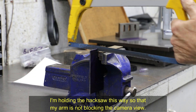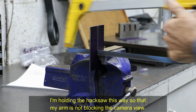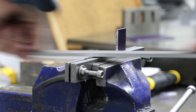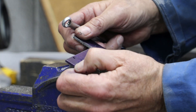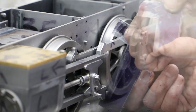After marking out the main section that needs to be cut away, I get busy with the hacksaw and some files. You may notice that I split the parts and I'm now only working on one of the pair. To help with the filing I've got the workpiece bolted between two bits of bar — they're not hardened but I can feel when I need to back off. Then a quick check before I move on.